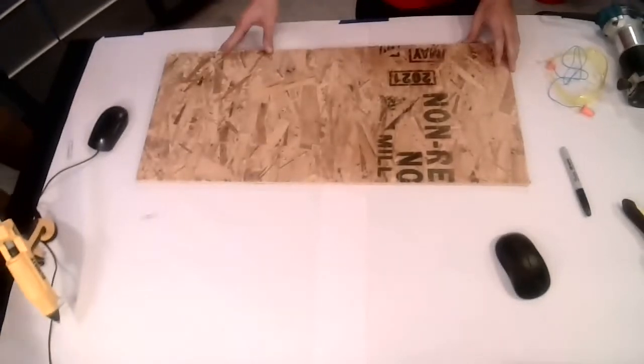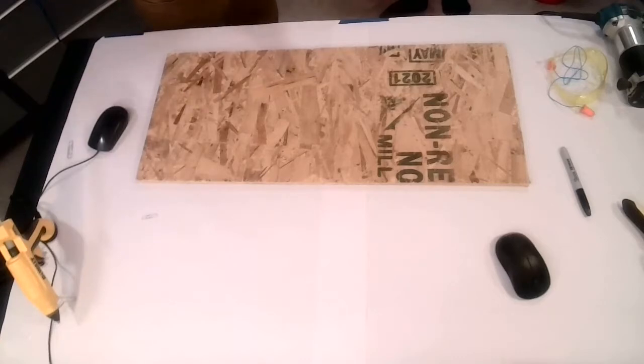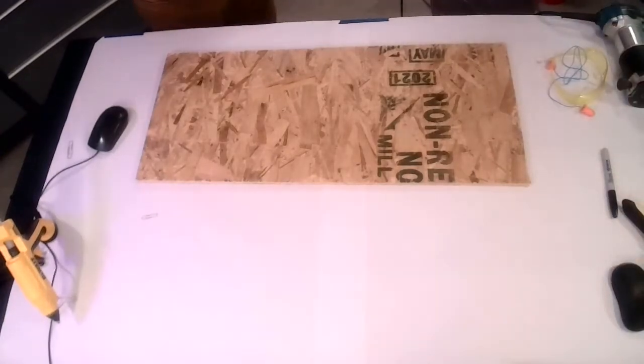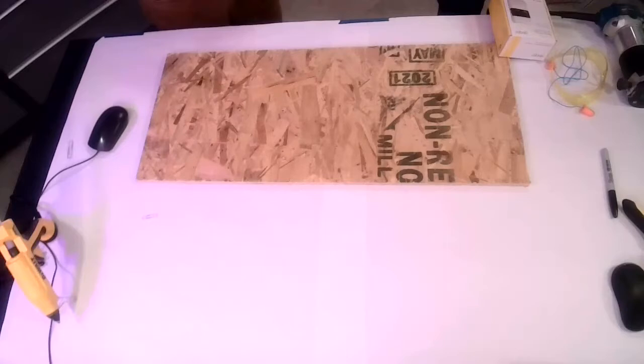Okay, I'm going to turn the floor over to Kyle here in just a sec. First thing though, we covered this a little bit, but just an introduction so you know what he's about to do. This is our Gold Heat product. You would typically see this installed underneath ceramic tile, porcelain tile, stone flooring, anything that you would put down with a thin set base. That gives you the opportunity to bury or encapsulate the entire Gold Heat product in that base and then rake your bed for your finished flooring and set your tile on top of that.